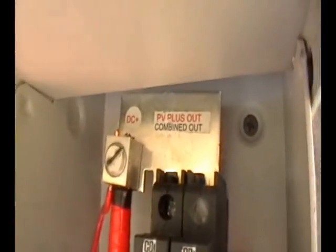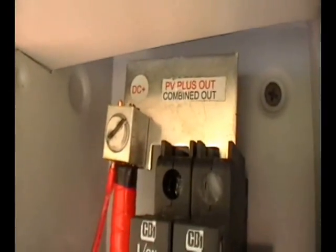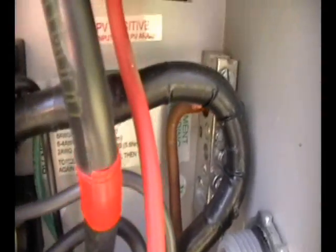Here's the lightning arrester. I had to take the plus and put it under the number two feed that goes to the positive bus here — there wasn't any other place to put it. The negative from the lightning arrester goes to the negative bus there, and then the ground goes to the ground back there in the back, which is grounded here and goes to a ground rod buried in the ground.